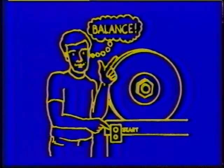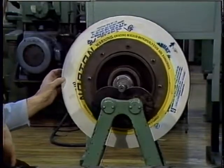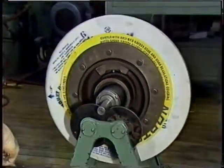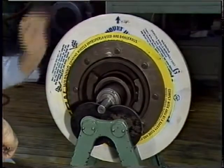After the wheel is mounted, and before it is actually used, it must be balanced. This is accomplished by removing the entire mounting assembly from the machine and placing it in either a balance stand with knife rollers or a balance stand with parallel ways. The balancing weights in the spindle are shifted until the wheel remains motionless in any position. Now the assembly is balanced and may be replaced onto the machine.